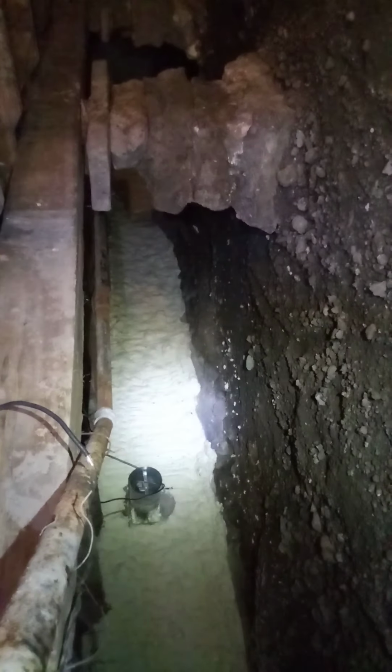Another thing too is mold. You can see I got some inline fans hooked up to some vents over here. The idea for mold is you have to keep the humidity and temperature down. I was trying everything. Vinegar, Concrobium mold control. I mean, after all this was messed up and I had it all dug out, huge mess, but it was all growing mold and everything too. So eventually I figured out that I had to get fresh air coming in with some vents over here and back there. I got fresh air coming in, being sucked out, and then keeping all this water out of here.